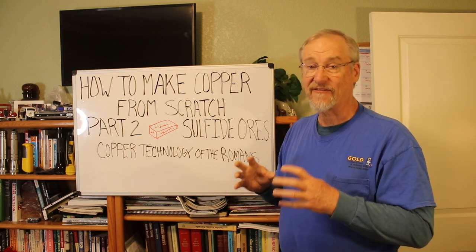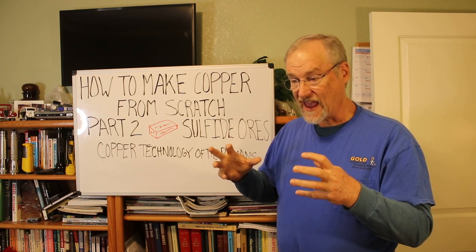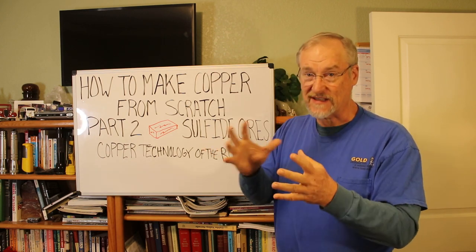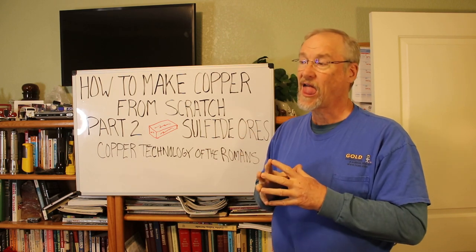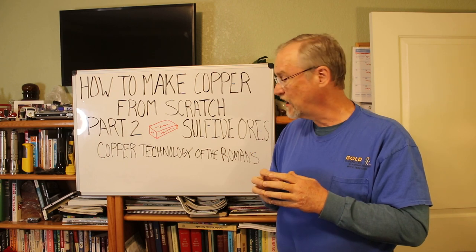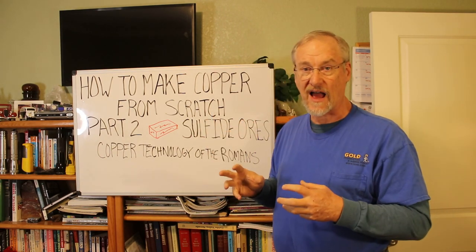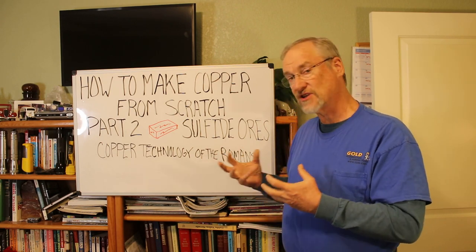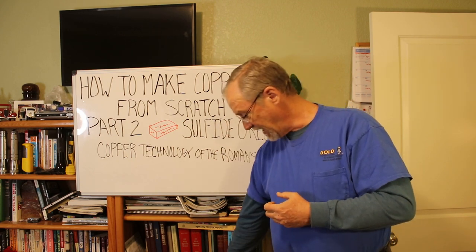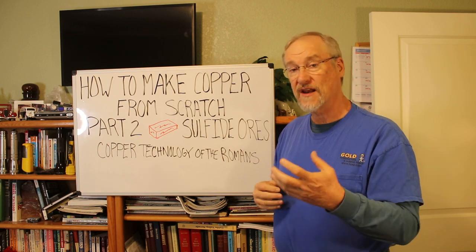So the next thing after they've taken that concentrate is they will go ahead and dry it out, get any moisture that's left. Of course, they separate it out from the bubbles and dry it out, and then they put it in a smelter. And the smelting process for this normally consists of basically heating it up real hot, and because the sulfur actually burns in the sulfide minerals. Sulfur is flammable, and they burn the sulfur and actually capture the sulfur and turn it into sulfuric acid.